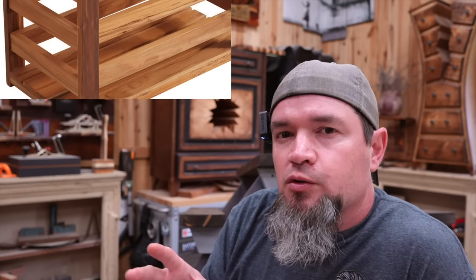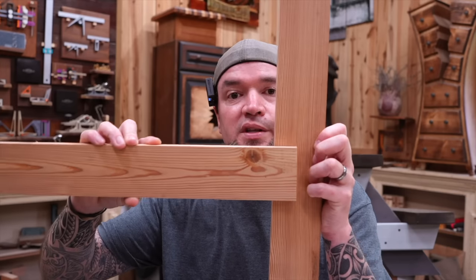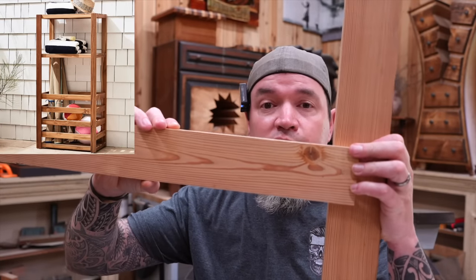Another super simple build — start by making a front and back panel. There's a floor at the very bottom but it's easier to add that at the end. The spacing between each horizontal strip is about three inches. Lay your 48-inch legs flat, measure up about five inches from the bottom for floor clearance, and put your first horizontal board on — this time overlapping to the center of the leg rather than a butt joint. Measure three inches from the top of each board and repeat until you reach your desired height, installing a flat shelf board at about the 20–24 inch mark the same way.